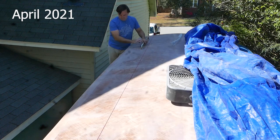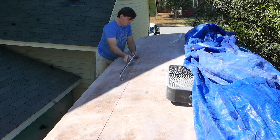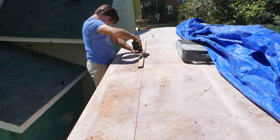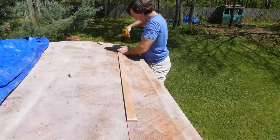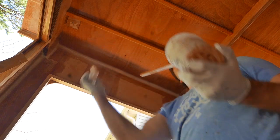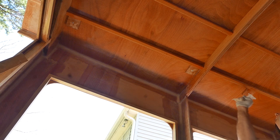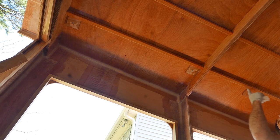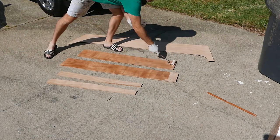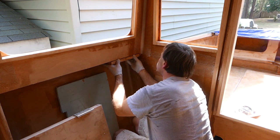We also locate and install backing plates for hardware. Grab rails will run along both sides of the cabin roof for added safety when walking the side decks. The side decks also receive large 1-inch thick backing plates for the large cleats that will be installed later.